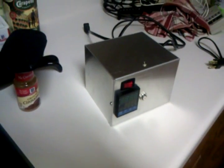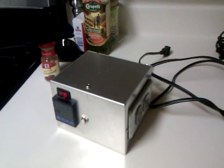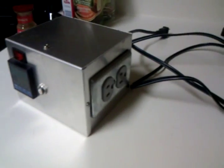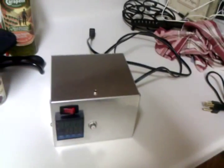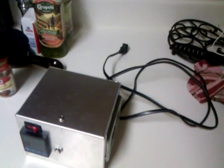Here is the base station for my sous vide low temperature water circulation immersion cooker. This is the station that monitors the temperature and fires off a relay which powers this outlet. It will eventually power three immersion water heaters — the single-serving type used to heat cups of tea or water.